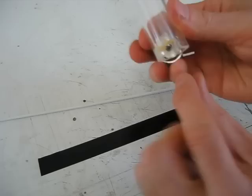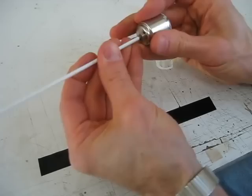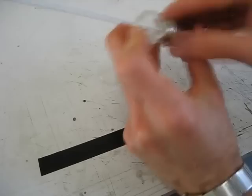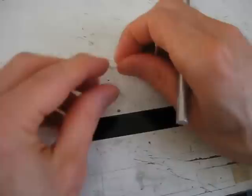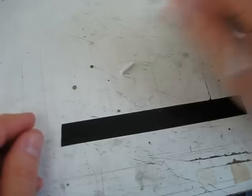The next step is to cut the piece of plastic tubing that's going to go on the motor shaft. I'll just put the shaft tube on the motor shaft and push it through the hole. Now I'm going to cut some vinyl tape for wrapping around the plastic. I want the pulley to have a round profile with respect to the belt — that tends to hold the belt on better. So I'm going to first put a thin layer and then put a thicker layer on top of that.